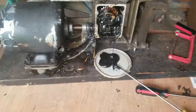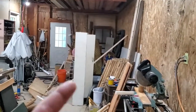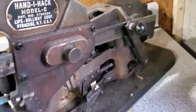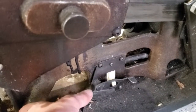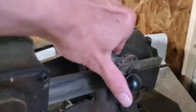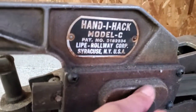So here we are a few months later - so much later that I now have the wall done in the workshop and a lot of other things, and all of the landlord's stuff is out of here. I also got this up and running. As you saw earlier in the video, the switch had failed - I got that replaced - so now when you put it there, and then when it finishes its cut it turns it off, which I'll show you in a second. This lever adjusts the amount of pressure the blade puts down on the cut, and this locks the blade from moving.